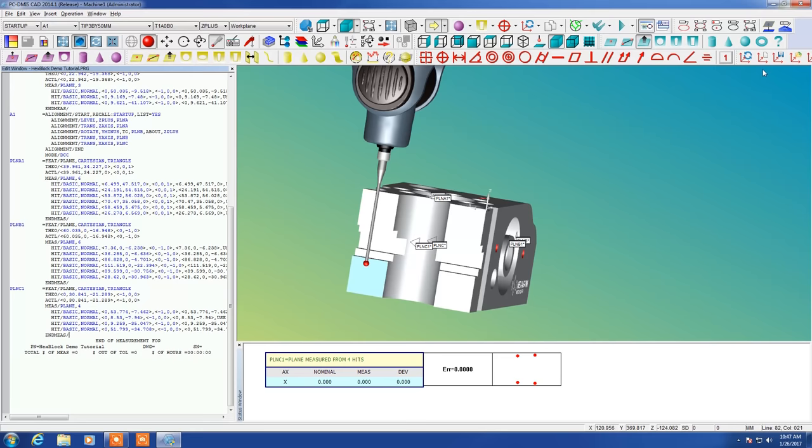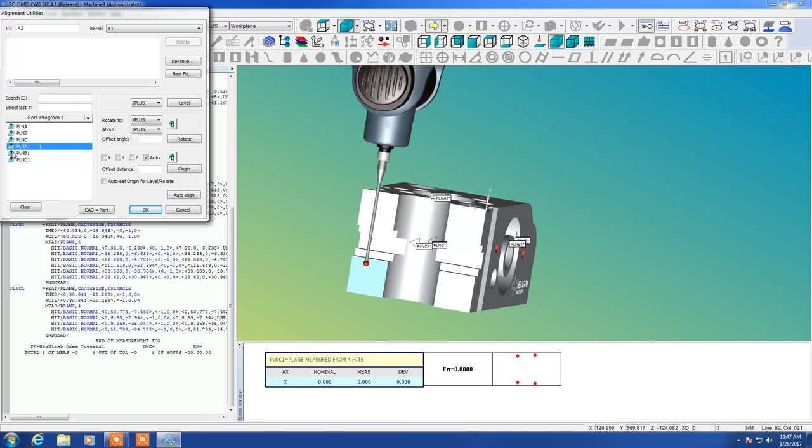So I'm going to open up a regular new alignment. Select the three planes that we just established. And now you see down here there is an option for a quick alignment. And if we read all these lines up at the top here, you'll see that they're exactly the same as what we just did in our manual alignment. So although that's a quick and easy function, it's good to know how to do all of this manually instead of just going for the quick one every time.